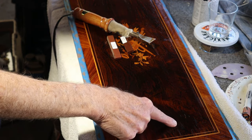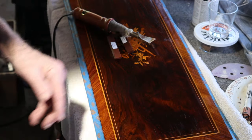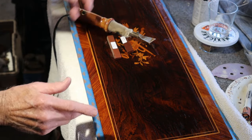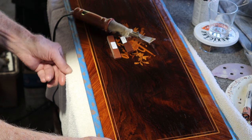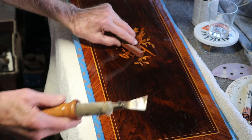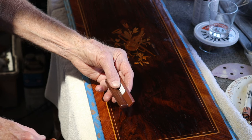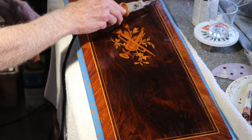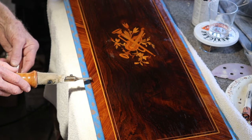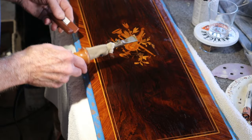After getting this area as light as I could, I stripped the entire lid without using stripper — it was a mechanical stripping using a card scraper. And I did a little bit of inlay — that would be right here, I'll get a close-up of that. And there were some defects just outside of that inlay. As I've shown in other videos, I used the iron and the shellac sticks to fill the voids, drag it off, and then using a credit card to scrape it level. So there's a small repair area there, and there's one on the edge somewhere that I've already treated.